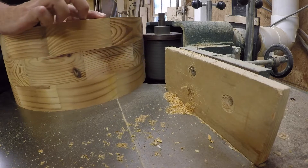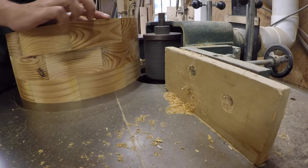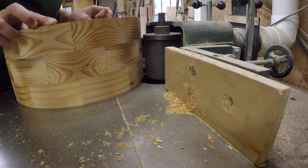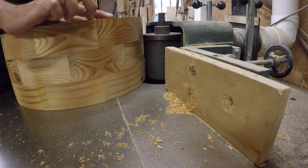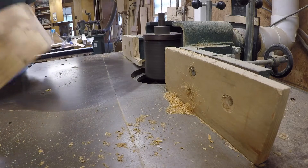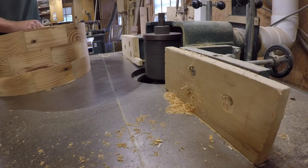This is probably one of my favorite parts because once you exfoliate the wood, you can actually see the true grain pattern starting to show through, and there's a lot of satisfaction with this. But you've got to go super slow when you're milling the outside of heart pine — it will bust and chip and ruin your day very, very fast.